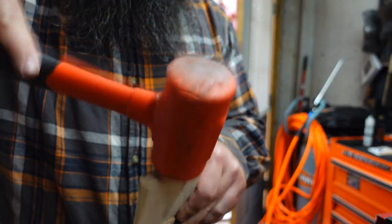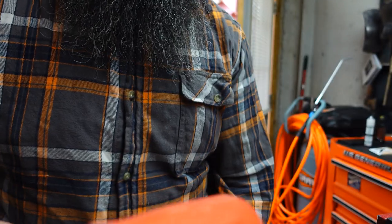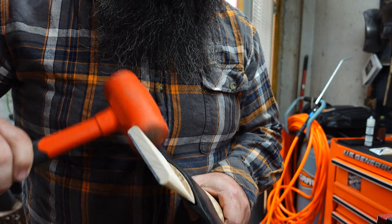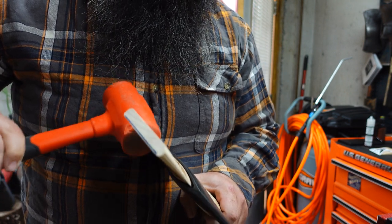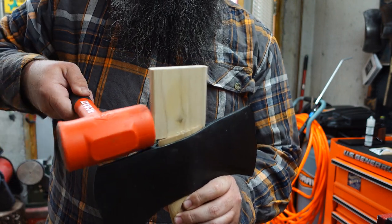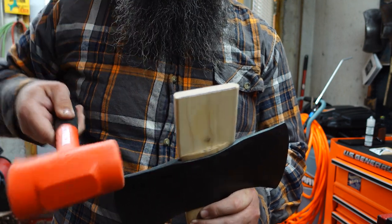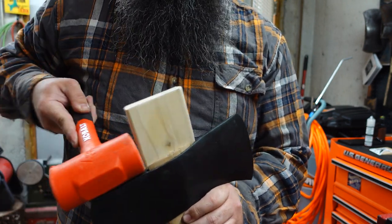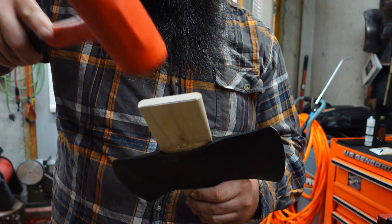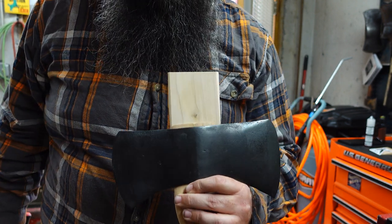To touch on the hanging proud and flush hang and all that stuff for just a second, my preferred method is proud, about a quarter inch, because that wedge is going to drive down in there and it's going to spread the top of that wood out just a tad more than it would if it was a flush hang. And to me, maybe I'm wrong, I don't know, but it just makes more sense to hang it proud